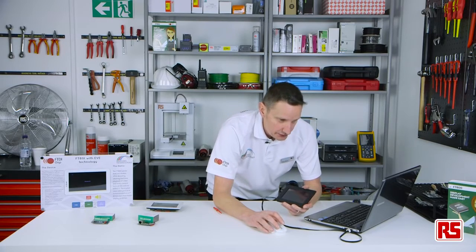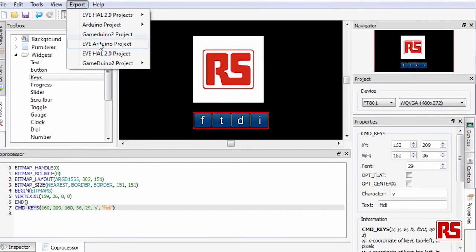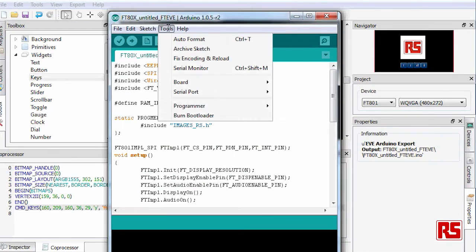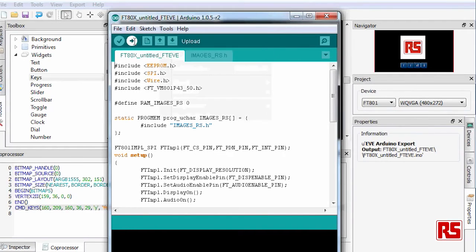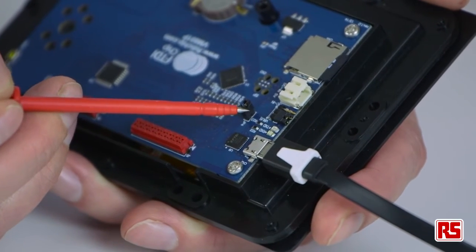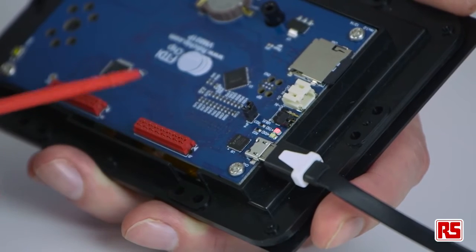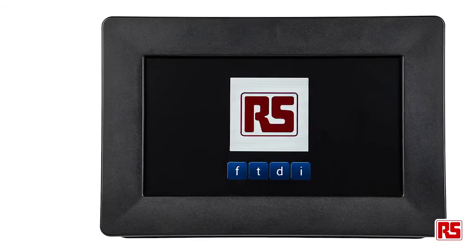Finally we'll export to Arduino library. The IDE for the Arduino opens automatically. Check that the correct serial port is connected and the correct board is selected, which is the ATmega328. We now upload, and the program that we saw on the screen editor will program via the chip. You can see the transmit and receive LEDs flashing as the device is programmed, and then we will see the program running with the exact same image that we had on the screen editor.